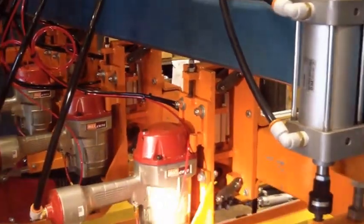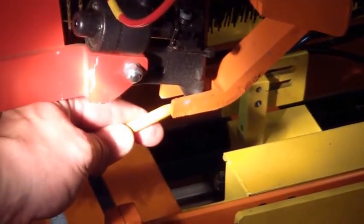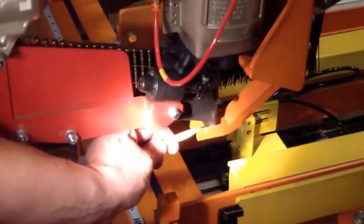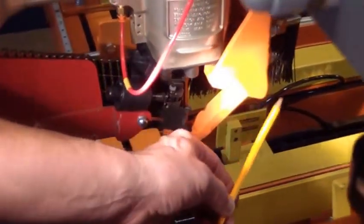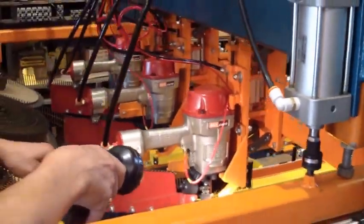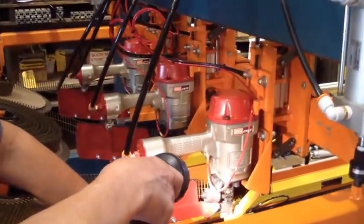And that's all with the tool mount, other than this shoe on the bottom. There's a gap distance between the very bottom and the nose of the tool. We usually set them about 1/8 of an inch to 1/4 of an inch. That's the reveal between the very bottom and the gap up to the bottom of this tool. That's adjusted with 2 bolts on the other side, here and here. That shoe slides up and down on the tool mount. All the air fittings are quick disconnect. Just slide them back and the airline comes right off. And that's it for the tool mount.